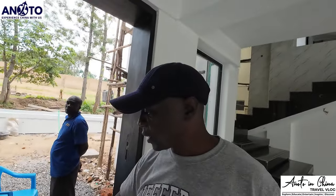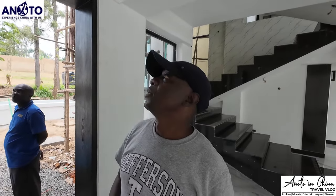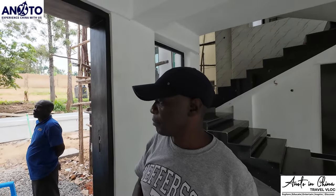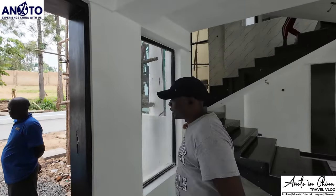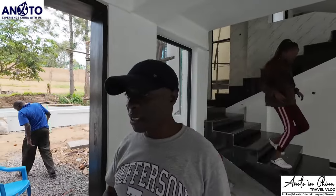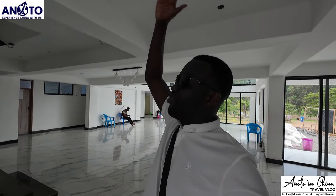A floor spring is designed to hang very heavy doors. This pivot can carry this door even if it was a height of 2 meters. If it was two times this door, it would still carry. It can carry up to 400 kilos. In China, especially the old buildings, they have humongous doors, very tall and very thick.